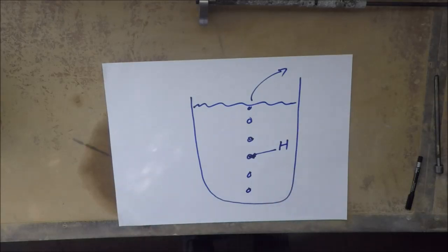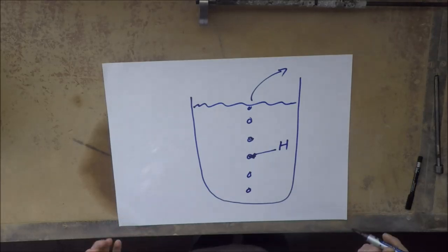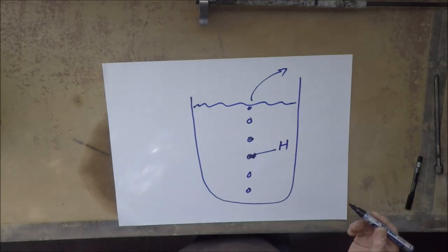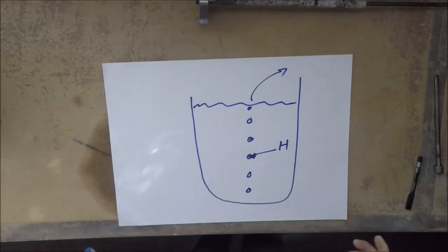Of those three steps, the slowest is the movement of hydrogen across the actual surface of the bubble. It follows that the more surface area you've got from bubbles, the better your hydrogen removal will be. This means smaller bubbles are better — for the same amount of gas, 1mm bubbles have 10 times the surface area of 10mm bubbles, giving 10 times the hydrogen removal. If your bubble size is above 5mm, you're wasting your time.